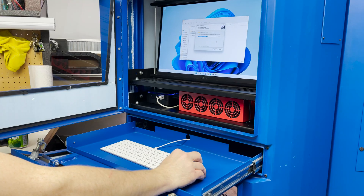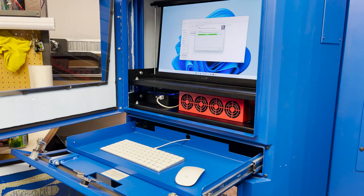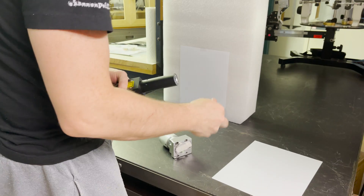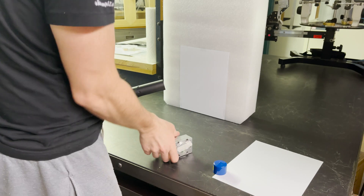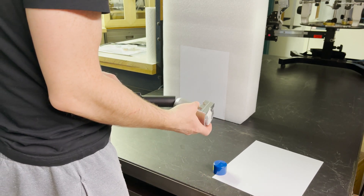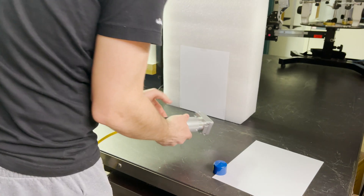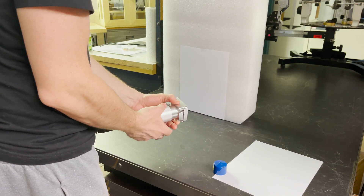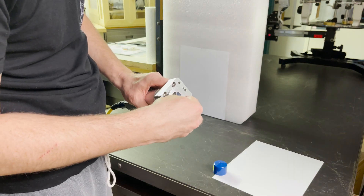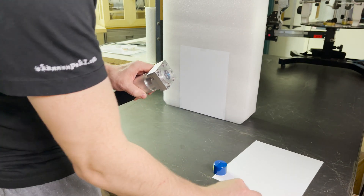Now that all of the main wiring is done, I get LINMARK 3DS installed so I can see if this thing's actually going to work. We have software. Now I'm ready to install the laser source onto the galvo head, so I need to attach this optical adjuster. I slide it on until it stops and then turn the collar to lock it. With the tape removed, you can see the crosshairs which we're going to use to align the beam.